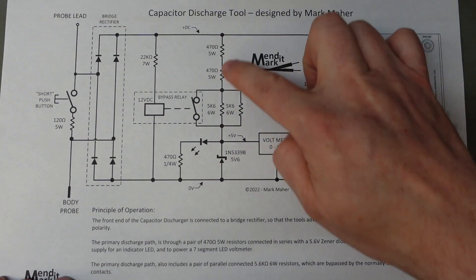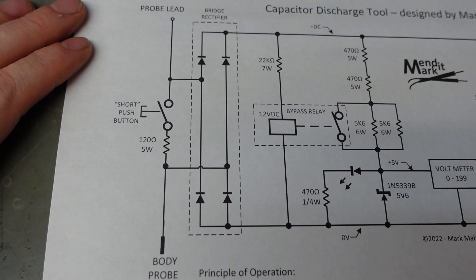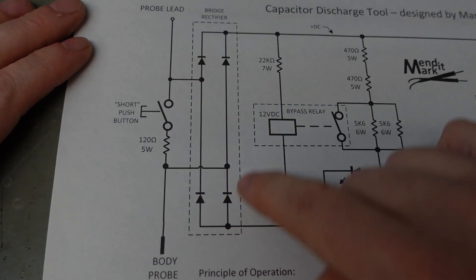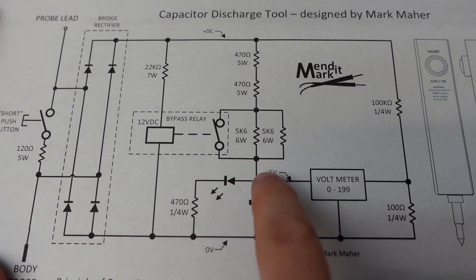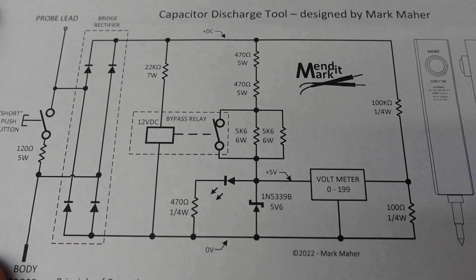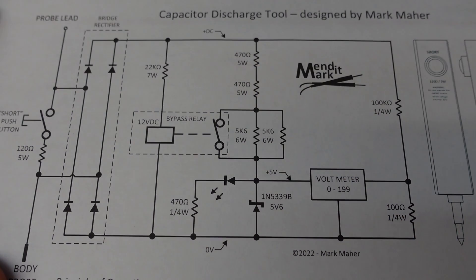That resistor chain is actually the main discharge path for the tool — the capacitor powers the voltmeter up. It did create a problem in that the tool is now sensitive to polarity, so to get over that I put a bridge rectifier in the way. When working out the load calculations it became clear that depending on what voltage was on the capacitors I might need a different resistance, so I put some extra resistors in series but bypassed them with a relay. When the voltage is sufficiently high, enough current flows to energise the relay and put this extra resistance in series, which stops it overloading the resistors and potentially damaging the capacitor.